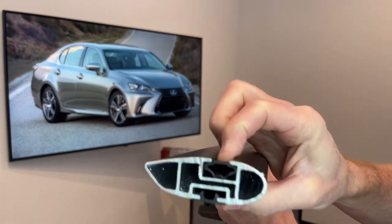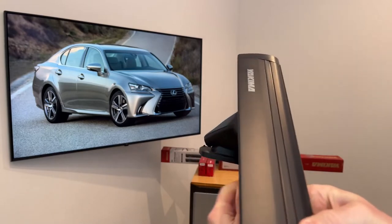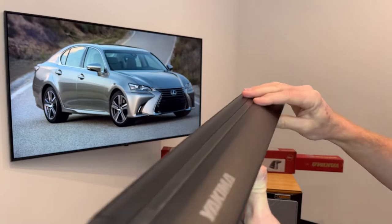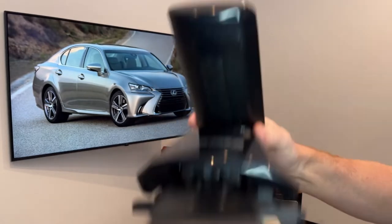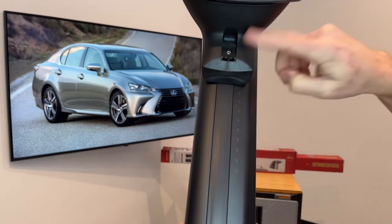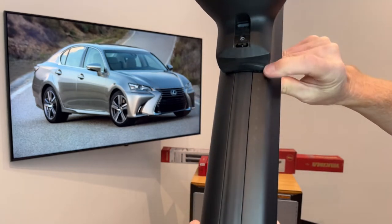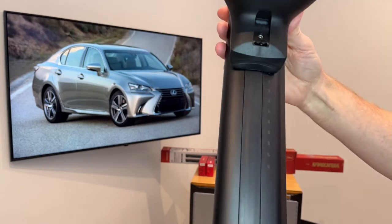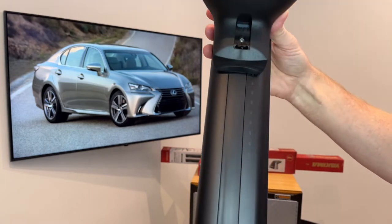There is a dedicated slot along the top of the bar to accommodate certain accessories and carriers for a very clean, integrated method of attachment. On the underside of the bar is an additional slot in which the tower is fastened, and alongside that slot are measurement numbers which correspond to numbers shown in the instruction sheet for your vehicle.